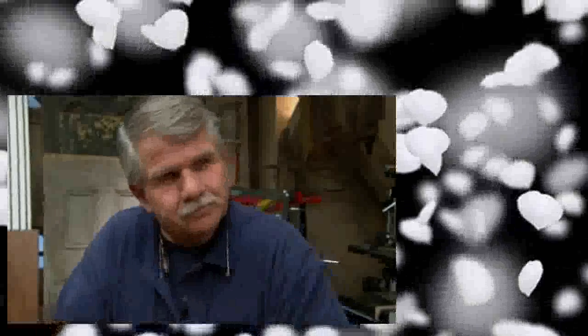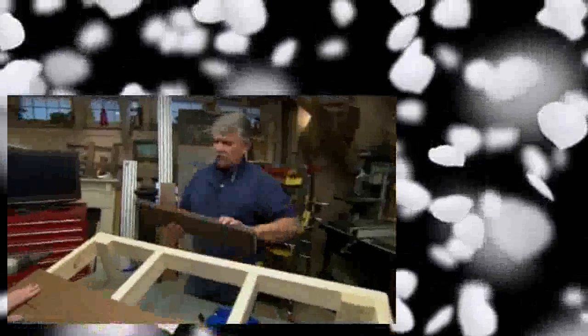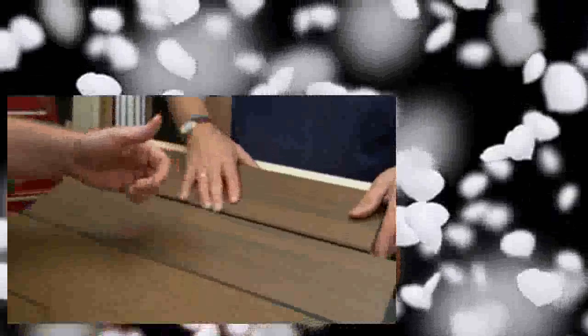So everybody's talking about invisible fasteners, though, for decks. Yeah, everybody doesn't want to see their fasteners, so invisible fasteners are the latest and greatest. So we have a fastener that will fit into a groove. When you buy your board, you can get one that's color-coded, and actually it will go right into the edge of the board like this. Put it in there like that. You drive your screw in there, you take the next board, and you put it up into it like that, and you have a hidden fastener. Already spaced, actually a pretty small profile, and because it's the same color, it really does almost disappear. It does almost disappear. Right.